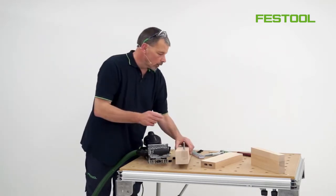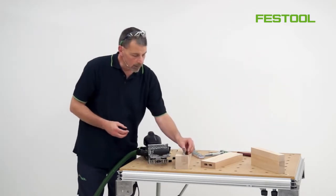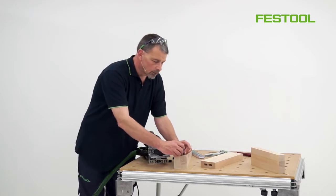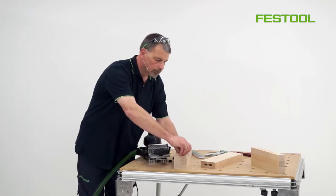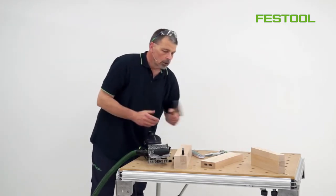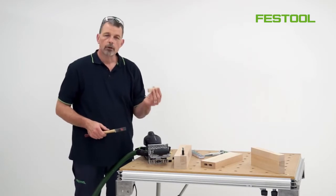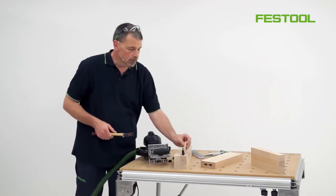So we also have a couple of plastic sections which form the domino profile, and these can be clamped or fitted onto the edge of this bolt. And then we can just clamp those into position. And of course, to make sure we have a really firm, strong joint without any twisting, we can also fit a timber domino into the slot below.